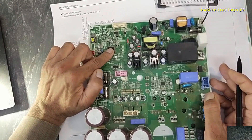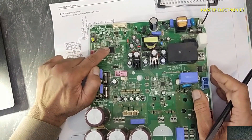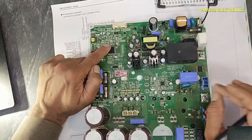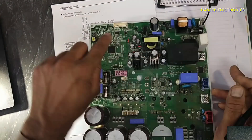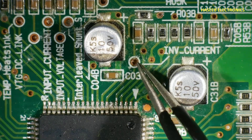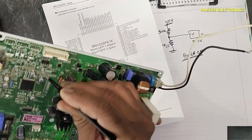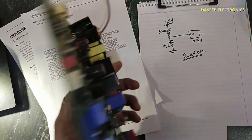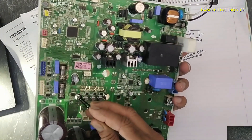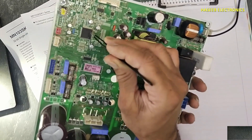Each pin of this microcontroller has a special dedicated function. When we are troubleshooting, we need to monitor that pin — trace the pin that is dedicated and connected to that circuit. For example, if this IC has a malfunction, its malfunction will reflect here. If we check the inverter current pin, this signal comes through a 1k resistor. Tracing this point to the back side — inverter current — this amplified signal reaches this pin and it monitors the current running through the IGBT.